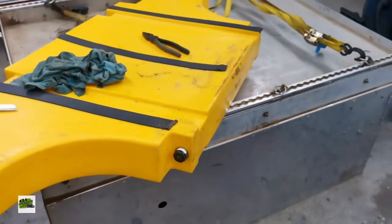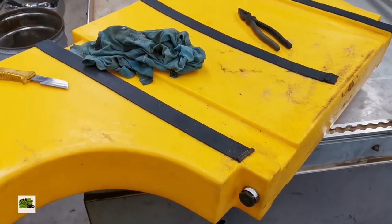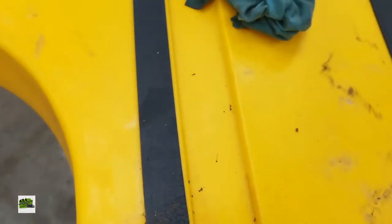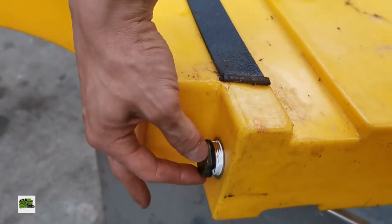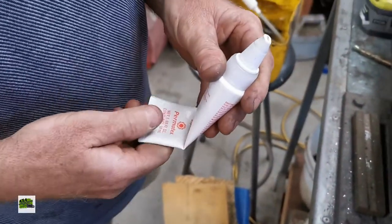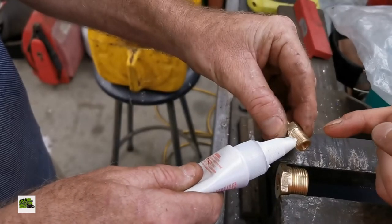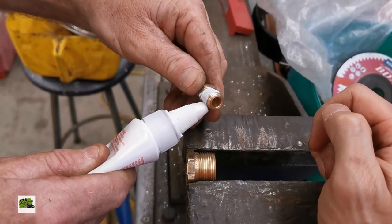We're back from the auto store. We've got one of those liquid sealants. Learn from my mistake — when sealing a fuel container fitting, you need to use something that is oil and diesel compatible, and apparently that needs to be a liquid sealant. Do not use thread tape designed for water on a diesel system. Now we're going to apply this paste on the thread. According to the instructions, you do not apply the paste on the first thread, but you do apply it around three quarters of the whole circumference — like so.